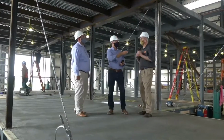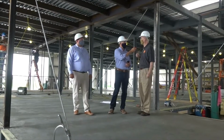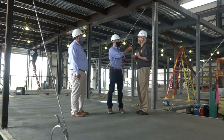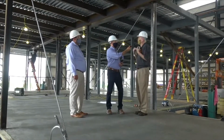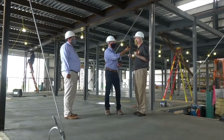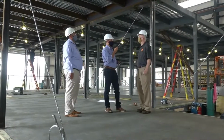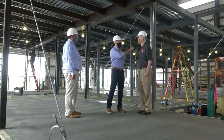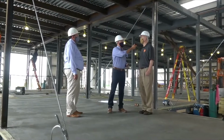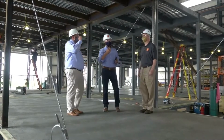That's correct. The other thing my department gets involved with is when we create the construction drawings, we use a building information modeling program, which is all three-dimensional. The architectural firm and the MEP firms also use that same type of BIM modeling program, so we can look at clash detection. So the entire building is designed and modeled as a digital model before we start construction. Perfect. So you're using BIM to bring all this together so you can get the accuracy like you did on the Good Samaritan Hospital project. Those MEPs were perfectly lined up. That's correct. How long have you been using 3D modeling BIM software? I'm guessing they were using it when I came on board, so probably a total of 7 years.